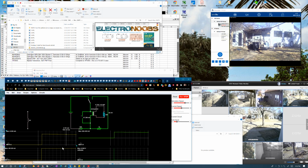Because again, this is slowly discharging, and this is slowly charging up, and again, with the same resistance, 50 milliamps is going to be its max. But that's what I'm surprised by. Okay, this has 50 milliamps flowing through it, even from the very get-go. I'd expect more than that to flow through the secondary at a lower voltage. I would expect it to be half an amp. So that's odd.